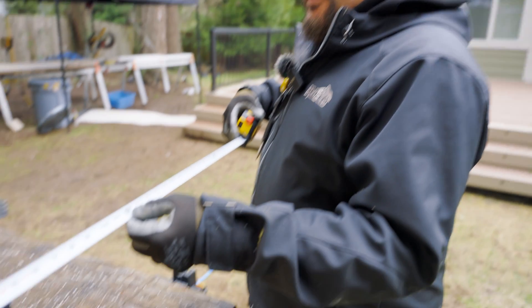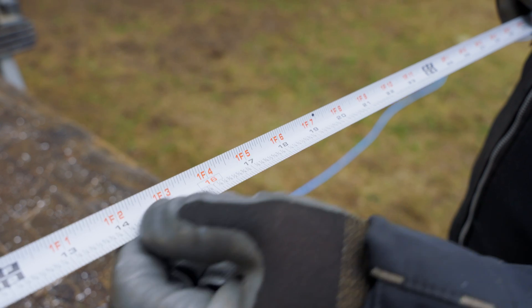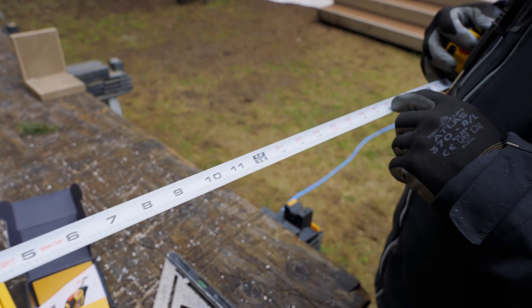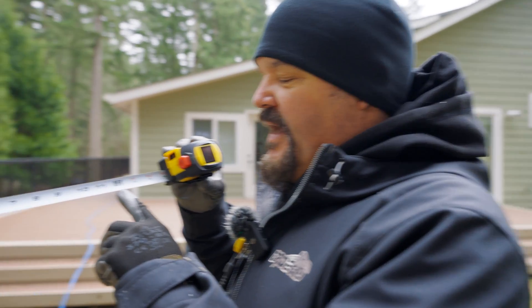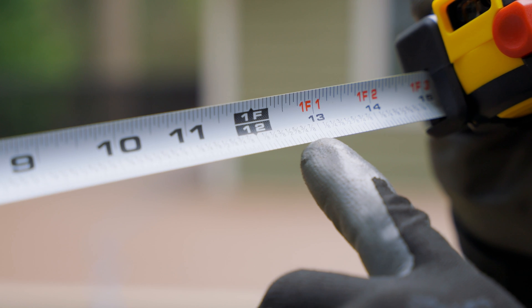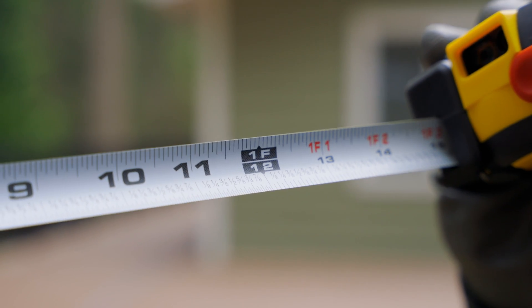After one foot, it goes into red increments — I don't know why, but it does. In the first 12 inches it has a pretty nice readout for as narrow as this tape is, which I kind of like. There's also something nice for people newer to measuring: it has increments of eighth inch labeled on the tape — eighth inch, quarter inch, three eighths, half, five eighths, three quarters, and seven eighths are all indicated right there, which is handy because newer construction people might say an inch and five eighths and end up cutting at three eighths by accident.